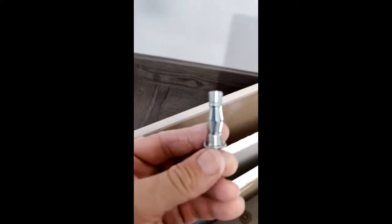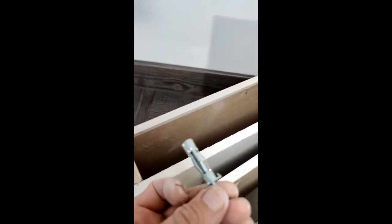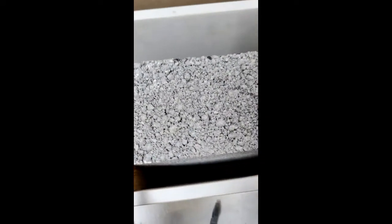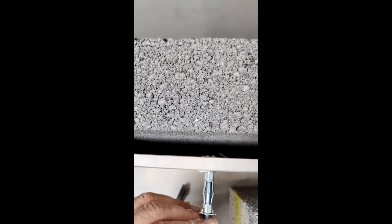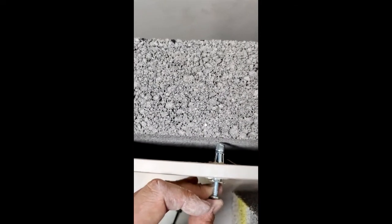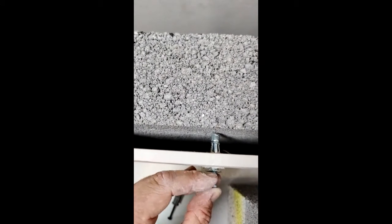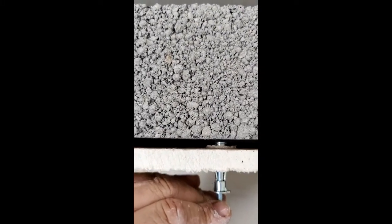Moving to tunnel bolts — for that to draw the end bit in, that will work in a studded wall and a metal studded wall. But when we come to a 19mm cavity, we're pushing it — as you can see, it stops about 3mm short. So that would not work, that would fail. And then obviously with a 7mm cavity, that fixing will not go in at all.